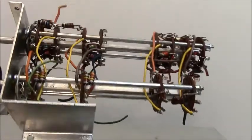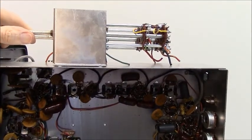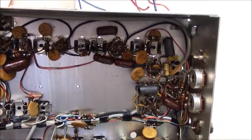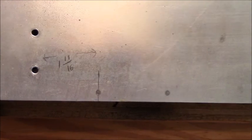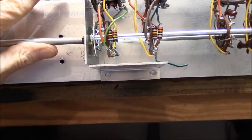We're going to mount this thing up here on the side. With it mounted up here on the side, you'll be able to run wires from the switch down to where it originally tied. That length of wire is not actually going to hurt it — it'll do just fine. Looking at the side of the unit, you're going to have to drill a couple of holes. Go back 1 and 11/16 inches from the original hole, where I have those two marked. The switch bracket is going to sit right there.